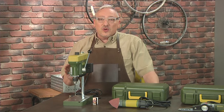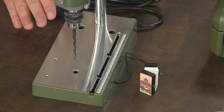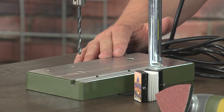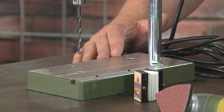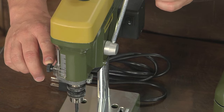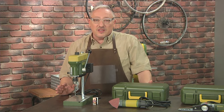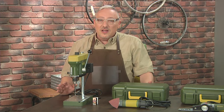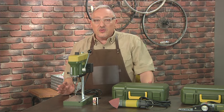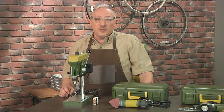The drill press can drill micro holes down to 1/64th of an inch. The work table is 8.5 by 4, and it's made of ribbed die-cast aluminum. The adjustable depth guide lets you control exactly how deep you're drilling. It has an extremely high rotational accuracy and belt-driven power transmission that offers three different speeds, 1800, 4700, and 8500 RPM, allowing triple torque at lower speeds.